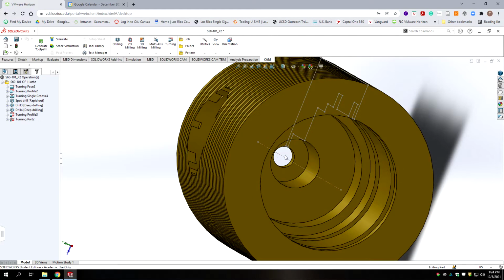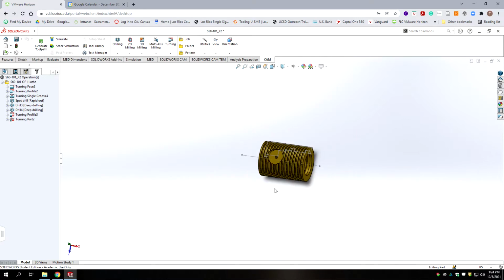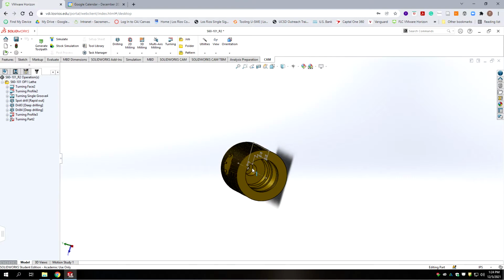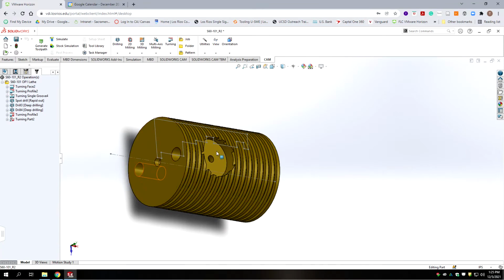The tolerance of this isn't all that critical. There's some loose area on it, but concentricity is important. So if we cut it from this side, we know the bushing that goes in here will be concentric to this hole. And if we have enough drill bit length, we can poke through the other side so that when the parting tool comes off, we don't get a weirdness there. Okay, and then we can also use that hole to fixture and indicate center for these milling operations.